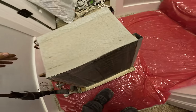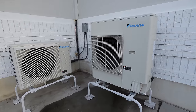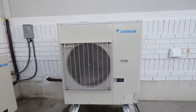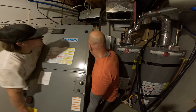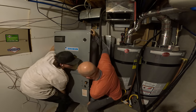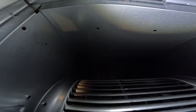We're able to move captured heat from outside my house to inside my house by manipulating the refrigerant phase changes. If we want to cool down the house, we just flip the direction of that refrigerant so that it vaporizes inside the house, capturing heat from the circulating air, and transports it outside instead. A heat pump does get less efficient the colder outside it gets, and here in Utah, winter temperatures can dip into the negative teens, which is why my furnace upstairs is dual fuel — burning gas on the few days where it gets extra cold, supplementing the heat pump.